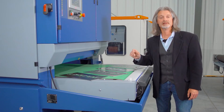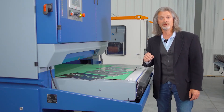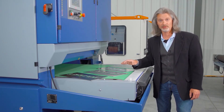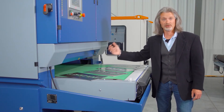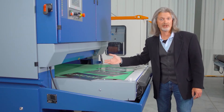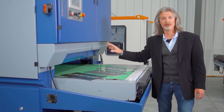You can also process stainless steel that has been pre-finished and coated. You can process galvanized parts and deburr them without removing the zinc coating. That is done through setting up the machine so that you can have a softer contact drum with a micro-finishing belt, for instance. But the point is that it is a very versatile machine.